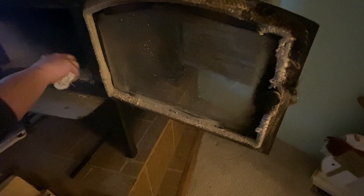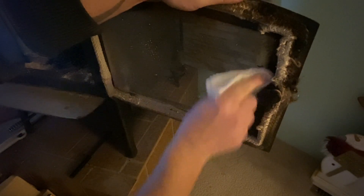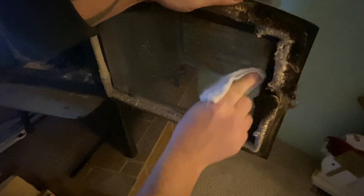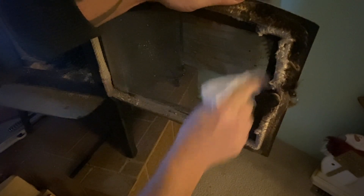The fire itself will actually clean most of the glass, but if you have a stubborn area with brown or black soot caked on, take a damp cloth, dip it in the ash from the fireplace — making sure it's cool to the touch — and use that ash to gently rub off the stains on the glass. It's basically the same procedure as using Brasso on metal. You can also purchase specialized glass cleaners, but I prefer natural solutions wherever possible.